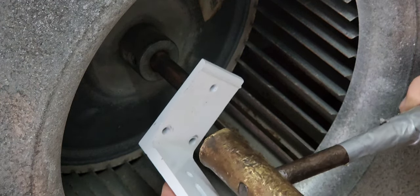Slide it into position and slide it back in the channels. Now that the fan housing is in place, reconnect your cable assemblies and then screw the 90-degree bracket back in place. Before you test it, the fan is screwed back in place with the retaining bracket and the cables are reconnected — everything's secure. Make sure it spins free, then reinstall the cover: the lip goes in, and install the four screws. Once you've got the cover reinstalled, turn your breakers back on and let's give it a test.